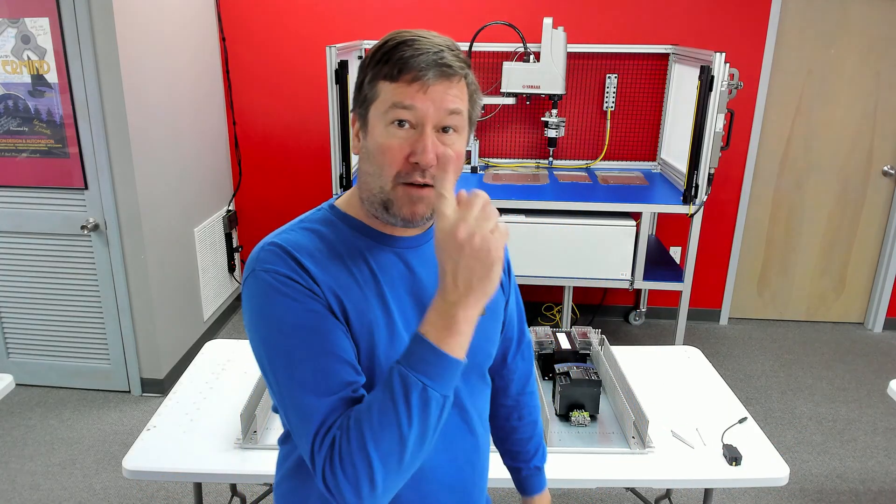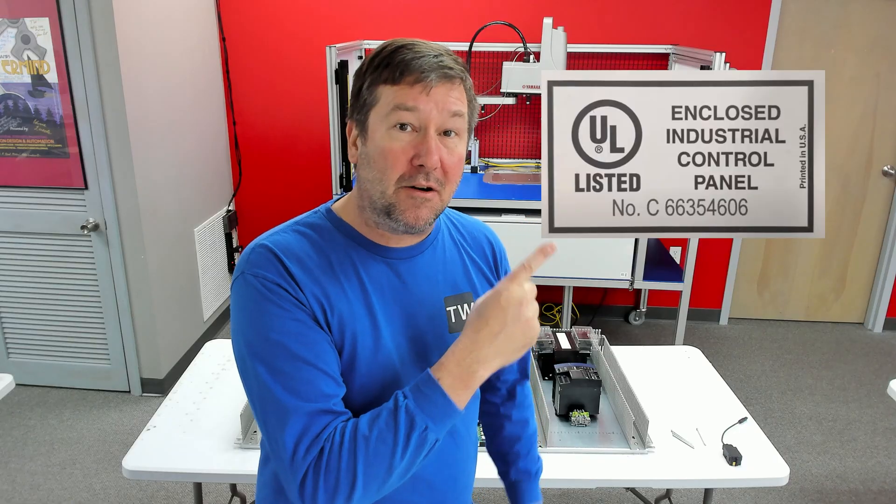So this is an additional standard that comes with an additional UL mark you can get for industrial machinery. I have actually never seen a machine that has a UL industrial machinery mark — so if you have seen one, put a link to the picture in the comments. What you're going to see more often is this mark right here. This is what a UL 508A panel manufacturer will put on there.